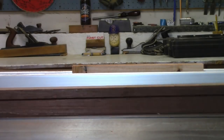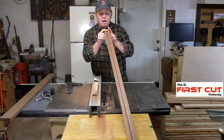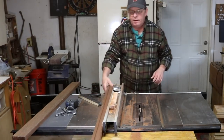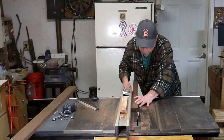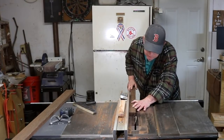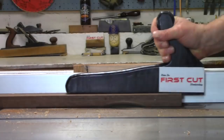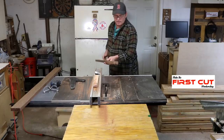Perfect - as you can see that's about three-quarters of the way through the board. Leaving that face down, all I really want to do from here is knock these corners off. You can do whatever angle on your table saw you'd like, but let me pause and adjust the angle on my saw blade. I'm doing 33 degrees - you could do it however you want. I want to set my fence so I'm just taking that angle off the edge of this board, careful not to get into my non-through cut. This is more for decorative purposes, but it's also a safety feature, especially with kids - take those sharp corners off wherever you can.